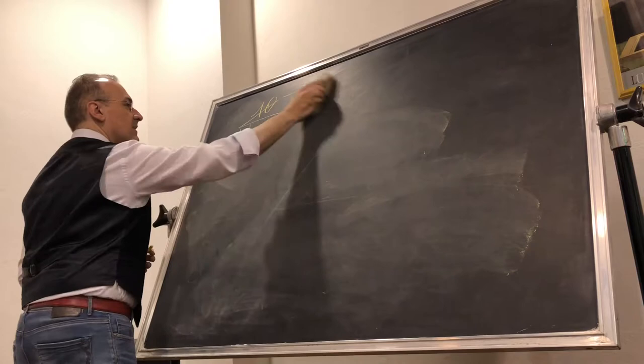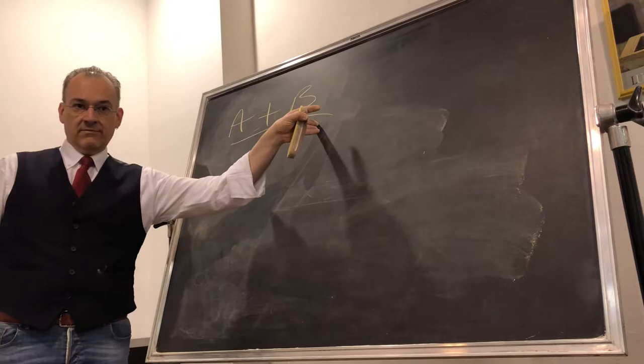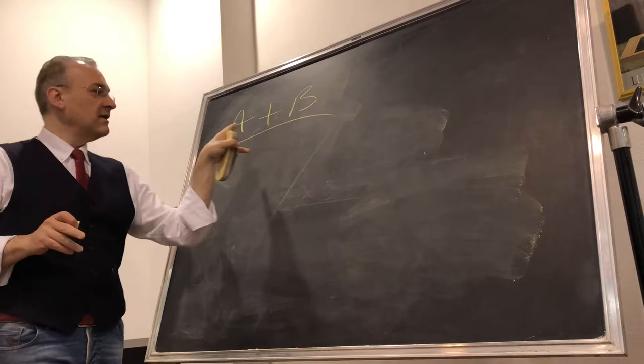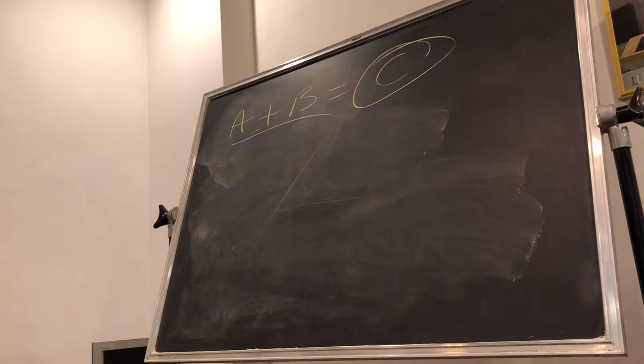And there is another thing when you work with materials, and that is heat. Because I have my A plus B material, okay? It could be plaster and water, resin and reaction, silicone A and silicone hardener, it's not important. You put two materials together. To become the hardened material, they need some energy. The energy that is produced during the reaction usually becomes heat. With some materials, like silicone, the heat is just 3-4 degrees, so you have no problem. You can put 1,000 kilos and put your hand on it and nothing happens. Afterwards I will make you try with a fast resin to see what happens.